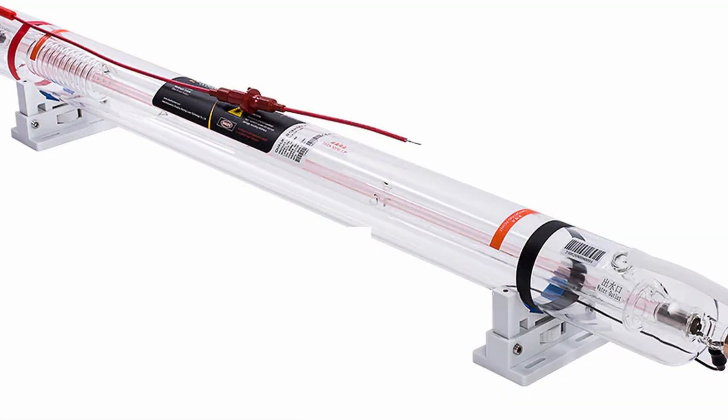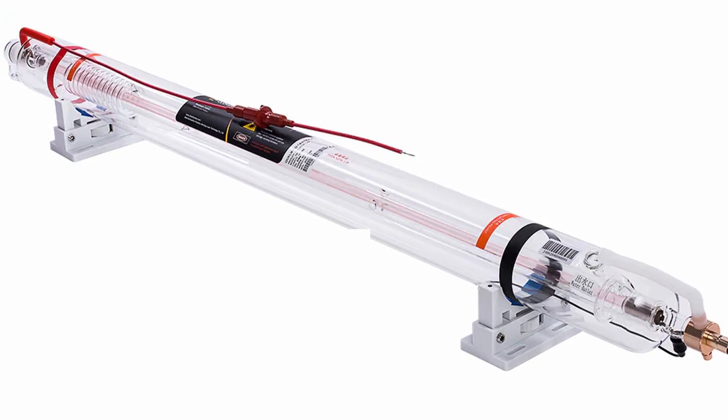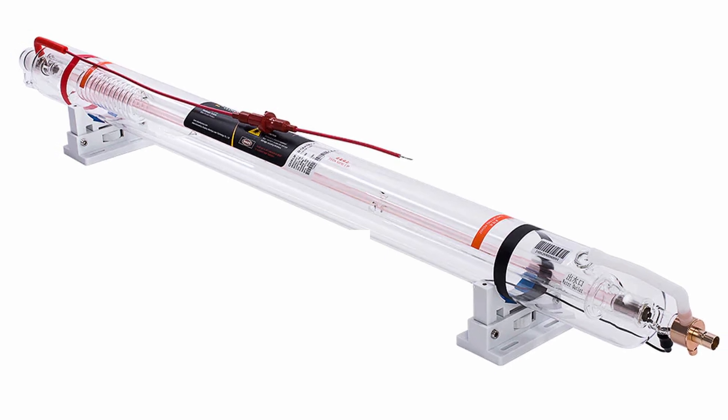Next on the list is the power. I'm glad I went with 90 watts — even more so than 100 watts. Once you kind of cross that 90-watt boundary, you start running into much bigger power supplies, much bigger tubes — and I mean bigger, they're longer — so everything takes more space and costs more money. There's a bit of a price jump once you get into the 100-watt range. So I'm very glad I stuck with 90. It's certainly ample power; I haven't really found much that I can't cut in my normal operation. No regrets there.